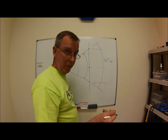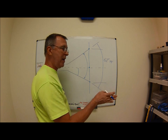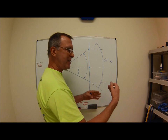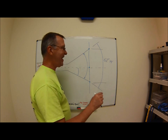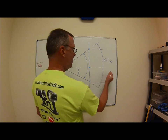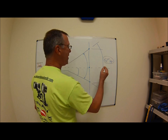So this is about 62 and three-quarter degrees. Now I don't know what kind of lathe you guys have, but I know that mine only has one-degree increments on it, and the incremental lines on the cross slide and the compound are just about the same thickness as the gap between the lines. Hitting this and guaranteeing that you're going to cut that angle is probably a shot in the dark. Here's the trick: take the total angle and break it in half.